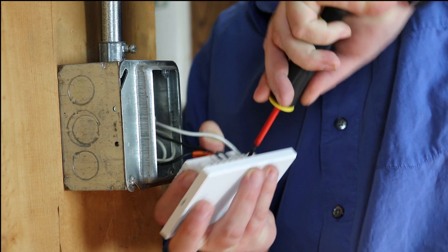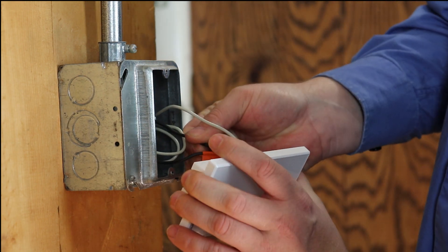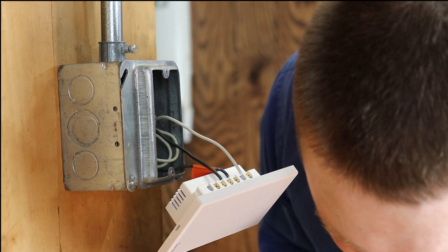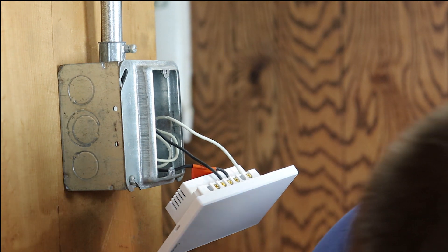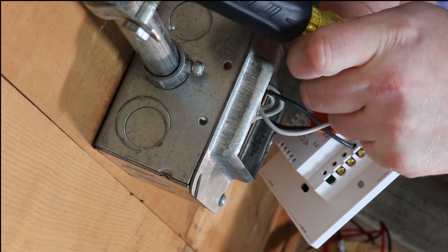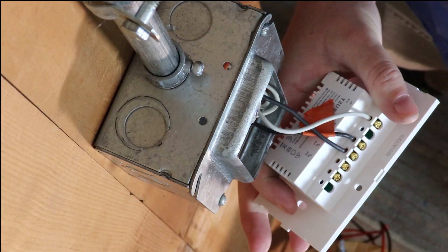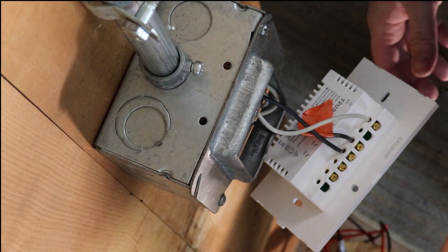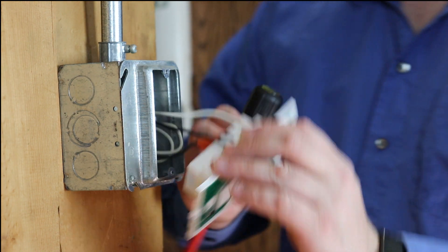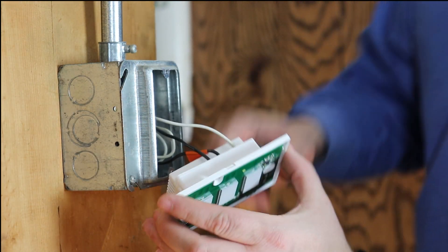I'm going to come here, get all these nice and tight — pull on my neutral, that's good; pull on my hot, that's good; pull on my line out, that's good. Now I'm going to pop the face plate off — I probably should have done this to begin with, but it doesn't matter what order as long as you do it. There are little indentations in here that actually help you get this plate off. Face plate's off — set it somewhere where it's not going to get scratched; you have a touch surface on one side and the circuit side on the other. Now we need to put our little plate on over this, and then we're going to put our switch in.